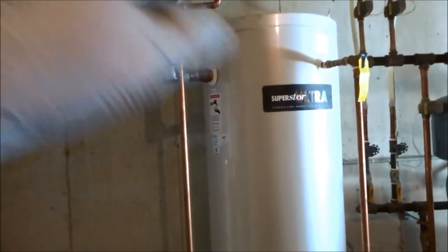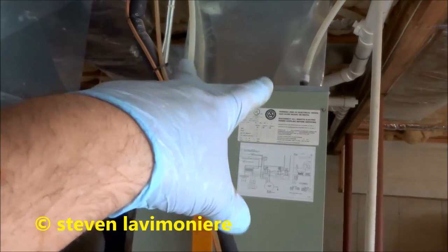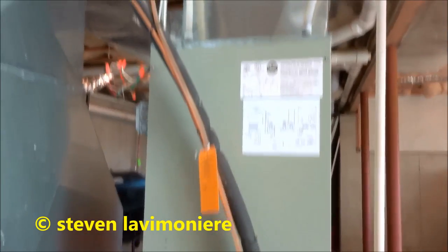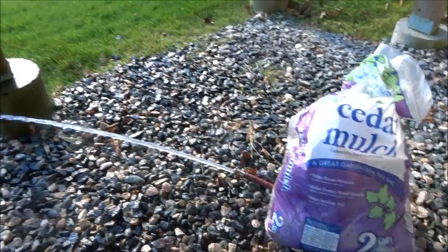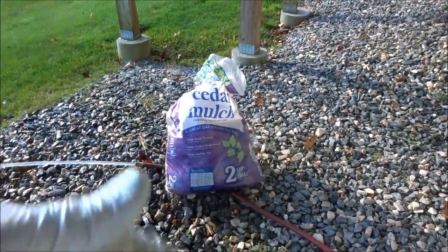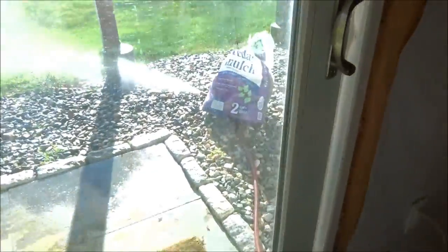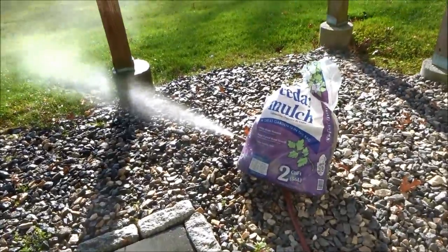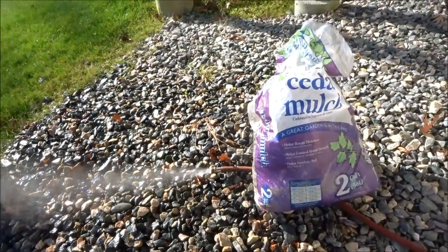Now my compressor's coming in hot, pushing all this water out of this tank. This has got antifreeze in it, so I don't have to worry about that. We got two heating coils, first and second floor, on the hydronic system. Bag on there so she don't go wild. She's a leaker, mama. It's good to put a bag on there because when this thing starts spitting, this hose is gonna go all over. Have that bag on it, otherwise that thing will be whipping around.